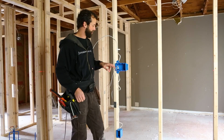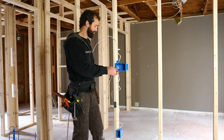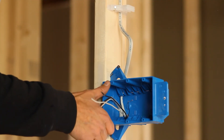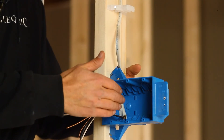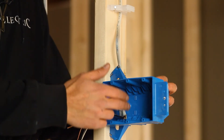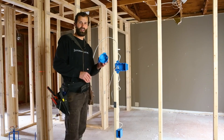My cable is now secured within 12 inches along the length of the cable at the point of entry, and my wire is stripped. This is going to be a switch leg — it's going to be in the first position of the switches, which is why I've entered it into the first knockout. I will then enter subsequent switches at the appropriate knockouts, whether top or bottom of the box, to help identify their location, prevent criss-crossing, and to keep my box ordered and clean.